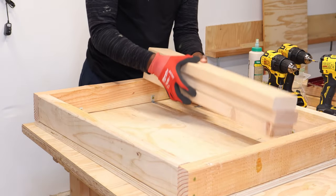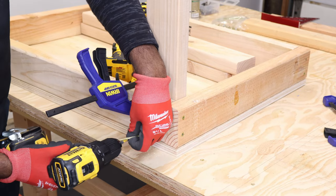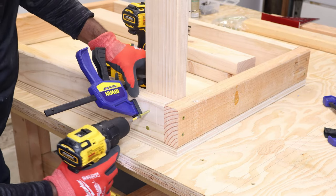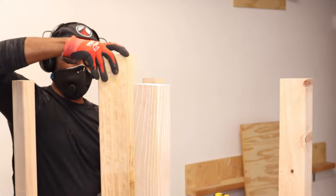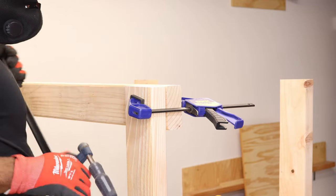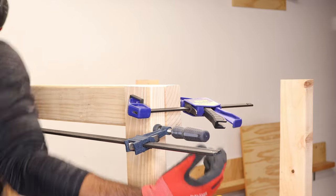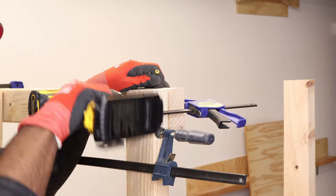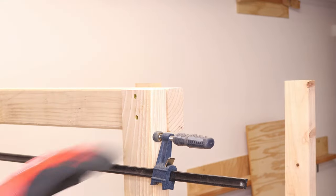Now we're going to grab the legs — clamping and drilling pilot holes for our legs, then using screws for that as well. You'll see we're taking advantage of the same three tools to quickly get through this process. Once we have that clamped, we drill on the legs for the other side — this is the last and final leg. Now that all four legs are done, we're grabbing the bottom supports and using a clamp to hold that in. Because our 2x4s are not straight, we're going to use our clamp to bring them back into square. We hit it down with our block, then drill our pilot holes and use our screws to put on the bottom supports. This lets us stay square without having to hold the piece in place while putting in our pilot holes and screws.